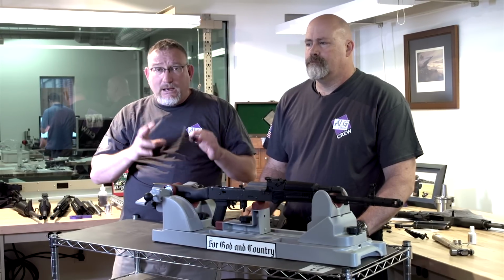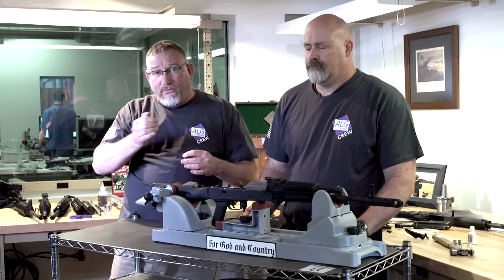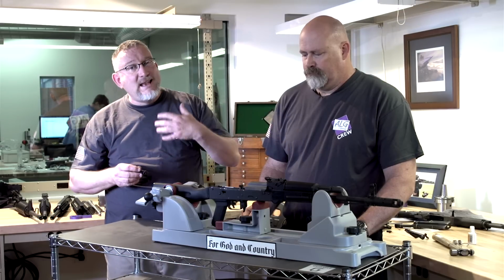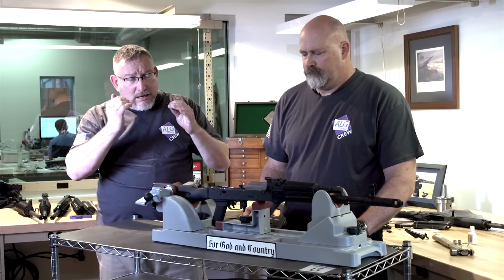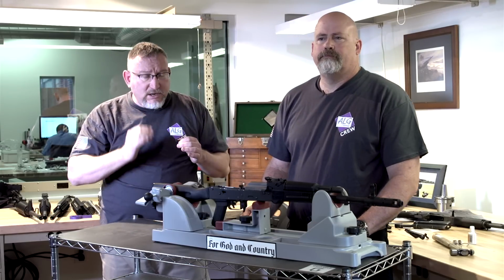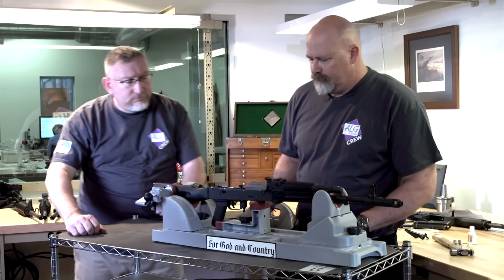Some rifles take a double hook trigger, okay? This single hook will fit in a gun that has a double hook trigger. A double hook is not needed. It's actually very difficult to make the two hooks identical in the sear height, and what you'll have is one rubbing more than the other. It's not needed. This single hook trigger right here does the job just fine.